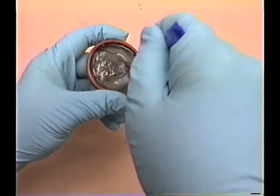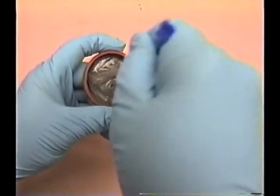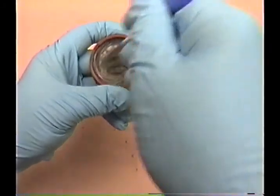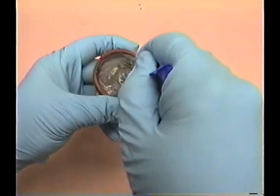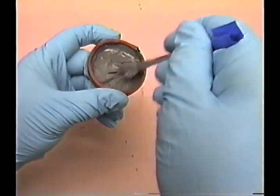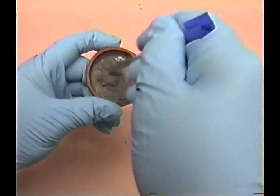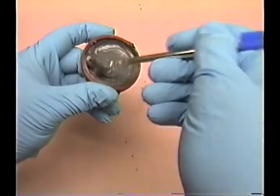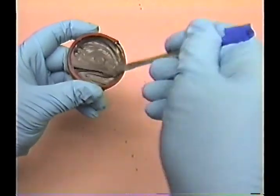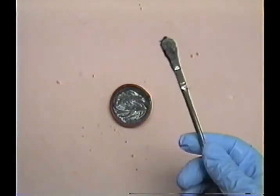Now, with JB Weld, we could use pipe resin. I don't think pipe resin is going to be any better, and then we'd have to post-cure it again. So I don't really want to post-cure a pipe that's already soaked with oil. And this, in the past, has worked. You just can't do this every time up in the front of the pipe, especially toward the back. This shouldn't be a problem. Again, because it's a spare pipe, this is not the primary pipe that Kim's going to be using. We can kind of do a little experiment here.